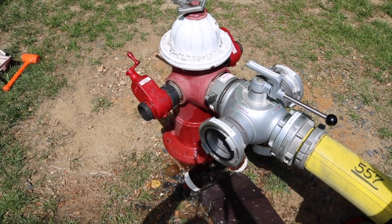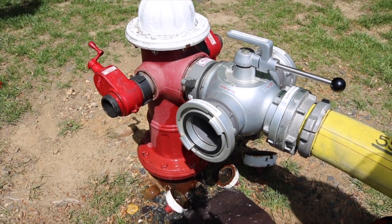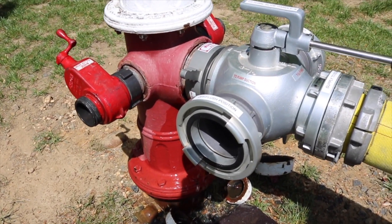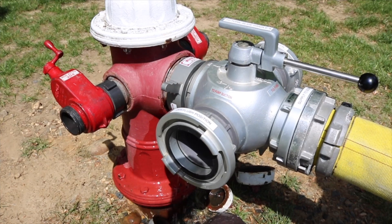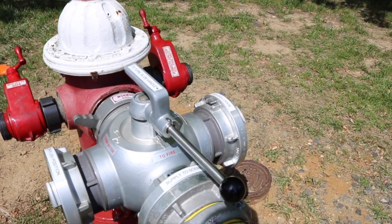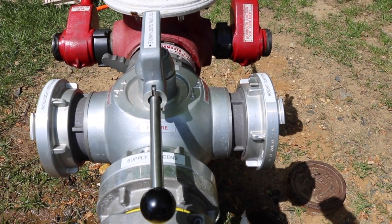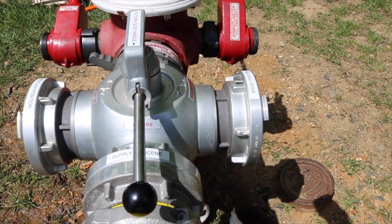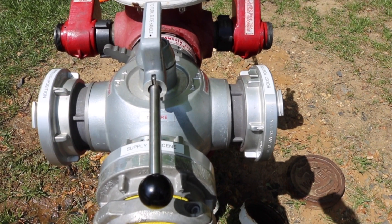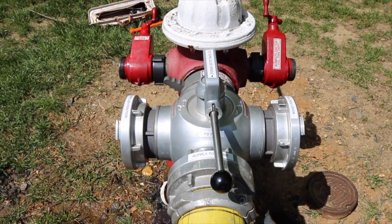On the left side as we're facing the fire hydrant it says 'to pump suction.' We'll connect a five-inch supply line to that connection on the hydrant to put it on an intake on our engine at the hydrant. On the other side of the hydrant assist valve there's another connection labeled 'from pump discharge.' We'll then take a five-inch line off of a discharge on our engine, and that will pump into the hydrant assist valve to increase the pressure for the scene.